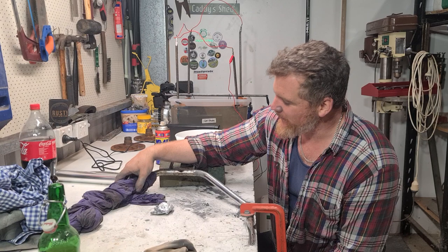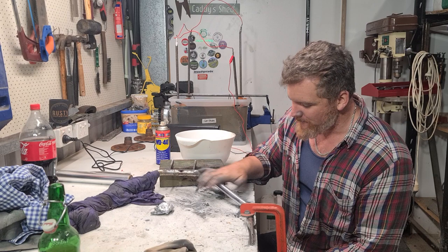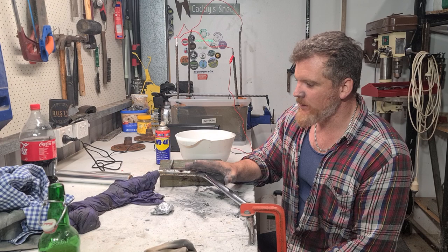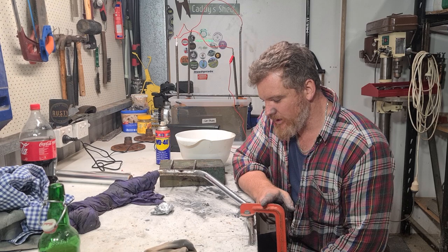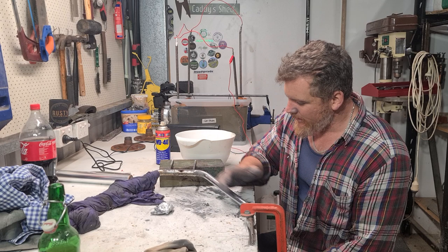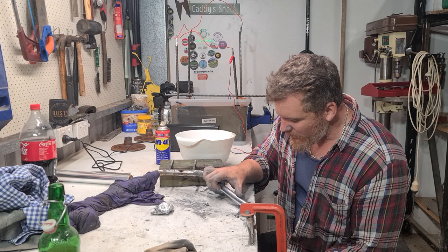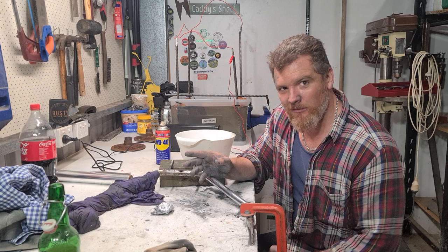I really wish I had considered the option where you actually soak it for a couple of hours. What I've done here is soaked this rag in Coke and then just adhered it to the bars — hopefully that's going to help a little bit. I think I've taken it as far as I can now and I've gotten results, so I'm going to park that there and flip this over to have a crack with the Coke next. Lessons learned for next time: introduce a G-clamp a lot quicker so you can get in behind it and work on it harder. I'll flip that over and give it a whirl with the Coke and the alfoil.